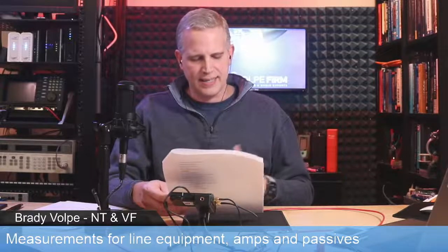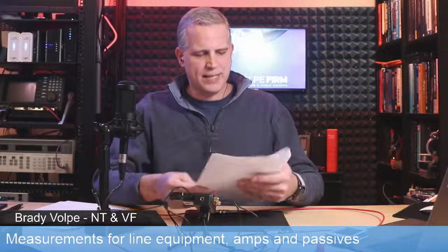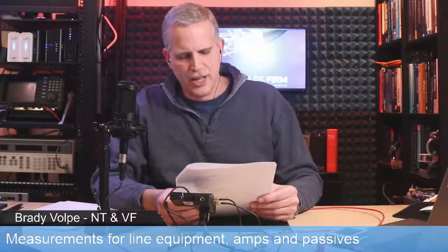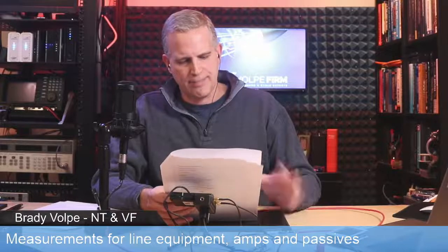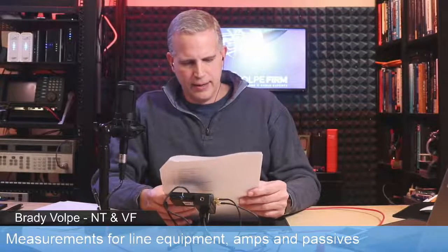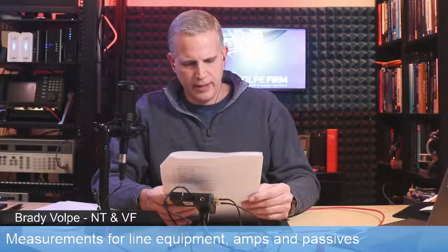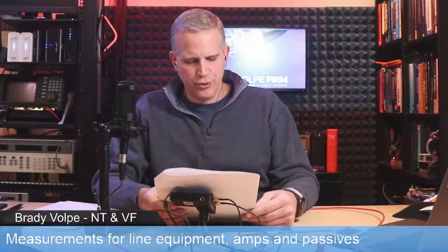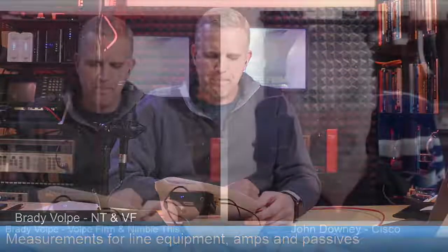His question is, he's looking at the event error log in the modem itself. He's getting a CM status event that says, CM status message sent, event type code 24, channel ID 25, DS, MAC address, OFDM profile ID 6. So, John, we sent this error to you. He's kind of wanting to know why he's getting this event code. John, I think you're familiar with this CM status event that he talked about.